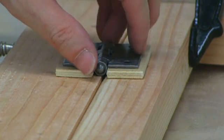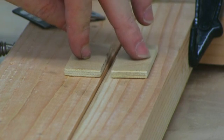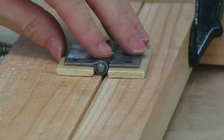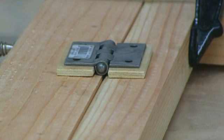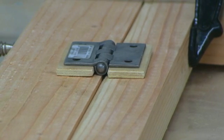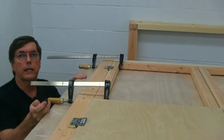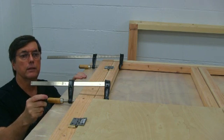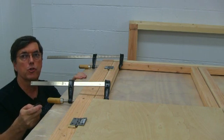This is how we're going to mount it. I'm going to take the hinge out, mount these spacers, and glue and nail them in place. Then I'll bring the hinge in and drop it right between that gap, make sure they're spaced out right, and the hinge will be glued in place. As long as I get the doors spaced correctly for the framework, I can get the doors to swing freely. I'll glue these little tabs in here first, nail them down, and then go ahead and mount the hinges. Once I get that far with this first set, I'll show you what it looks like when it's completed.